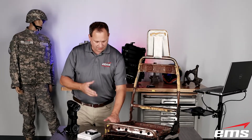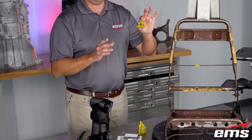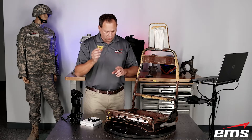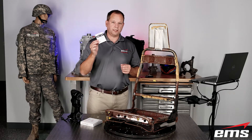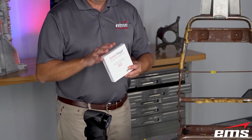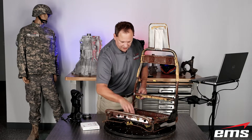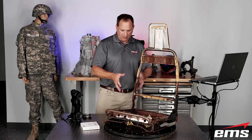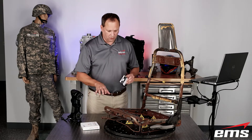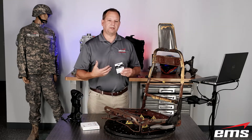First, we'll use our rotary table in this case because it's a small part — we can take advantage of that. Secondly, we'll use some of the triangles. You've seen these in other videos, and if you haven't, go watch our tips, tricks, and techniques video on using the 3D scanners. We'll throw a few of these in here. We'll use normal targets — Creaform-type targets where we can — and then we're going to use a new product we've developed called Speed Target. So the first thing is I'll put some artifacts out here. This helps us go up vertically and helps when coming around the backside. Then I'll go ahead and throw targets on this part in the flat areas where I can, and then we'll talk about the Speed Target system.